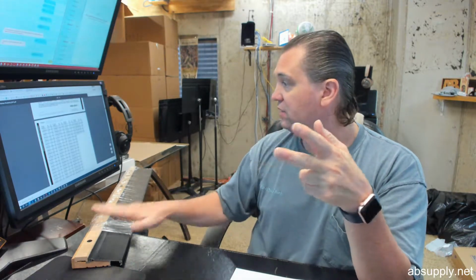Moving on, you can do the D finish, which is the dark bronze anodized. You can do the SN finish, which is satin nickel. Now, satin nickel is interesting in the sense that it's an anodized finish over aluminum, so it does not match perfectly anything that's actually satin nickel, something that's made of brass and has a satin nickel finish on it. It will be quite complementary, but not exact. So if you're thinking of satin nickel, look at the images or the videos that we have posted online for those thresholds in that finish to be sure that you're comfortable with satin nickel from Pemko. And that covers all of them. So aluminum, bright dip gold, dark bronze anodized, and the satin nickel are the 4 finishes that you can get with this.